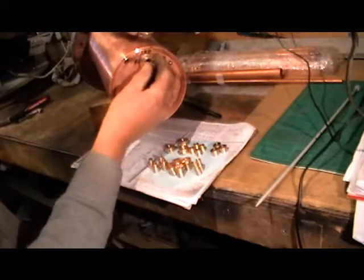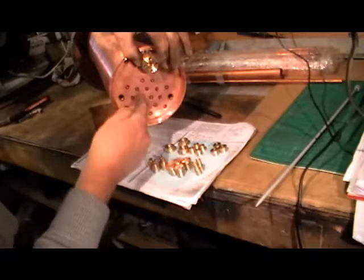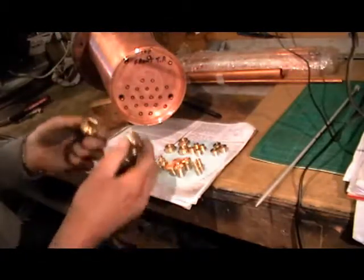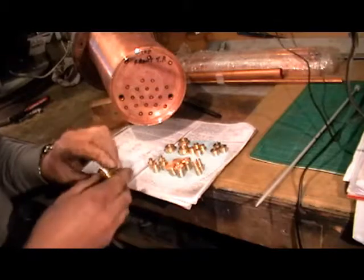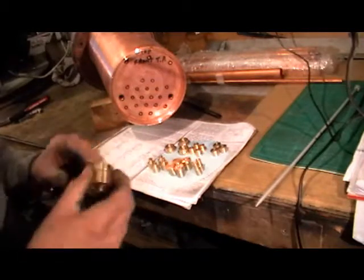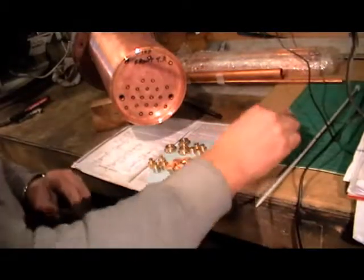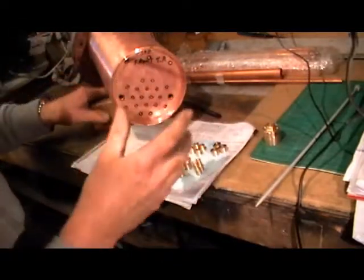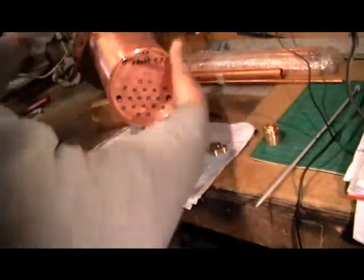So that's going to be going into the front plate — it'll be bolted on, with the steam pipes coming off at 45 degrees. That's my steam header, and they're all made out of gun metal, which is basically cast phosphor bronze. Just a word of warning: if you're thinking of doing a boiler, don't make them out of brass, because steam has a funny reaction on brass — it causes it to dezincify, apparently. So make sure it's phosphor bronze that you're using.